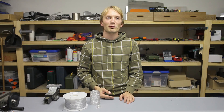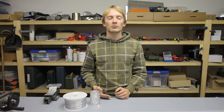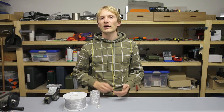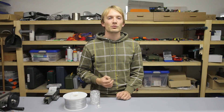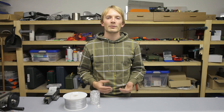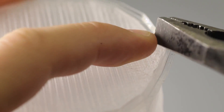For 3D printing, you'll probably be using polycarbonate without fiber additions, but just by itself, polycarbonate is already a pretty impressive material. It is a bit stiffer than ABS, but not quite as hard as PLA. It has an enormous amount of layer bonding and it takes way higher forces to break a printed part than one made from normal plastics. Even getting the brim off your print can be quite challenging.